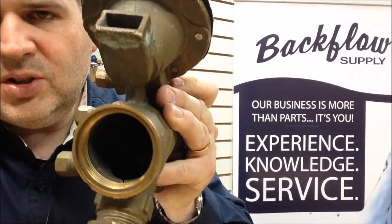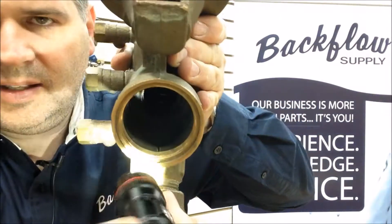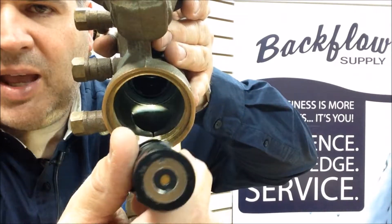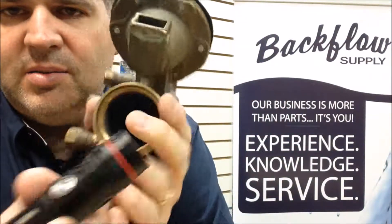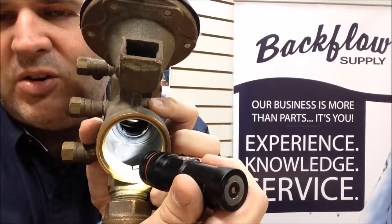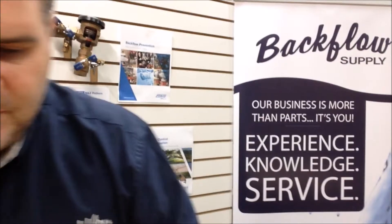Also on this assembly, I want you to see another example of brass expanding where it doesn't show through to the outside. Right at the six o'clock point you can see that expanded crack — it's not a very clear picture with the flashlight in the way, but that crack expanded and cracked the brass without going through to the outside. That's just normal casting there. You have to look into the causes of the leaking. On that particular one, it happened in both checks.